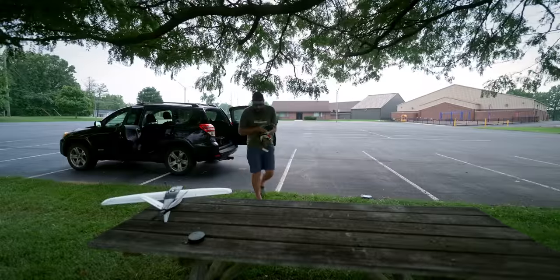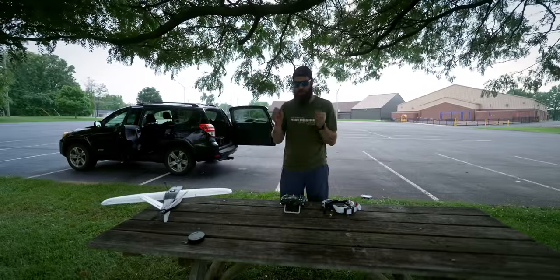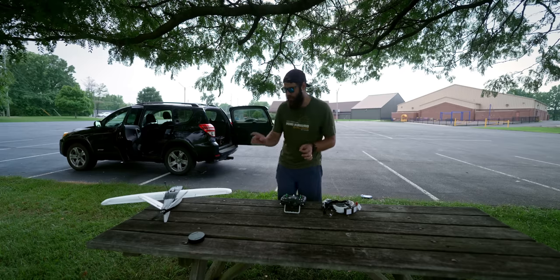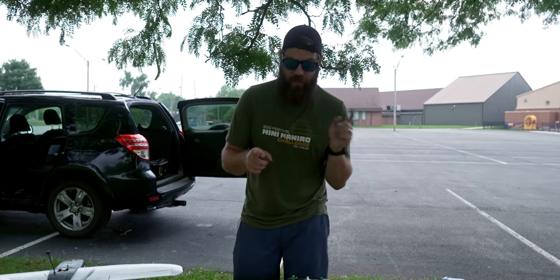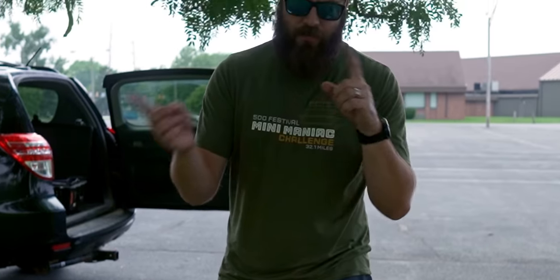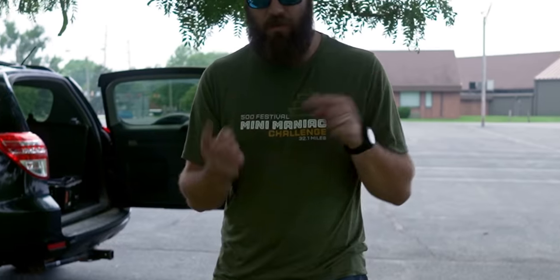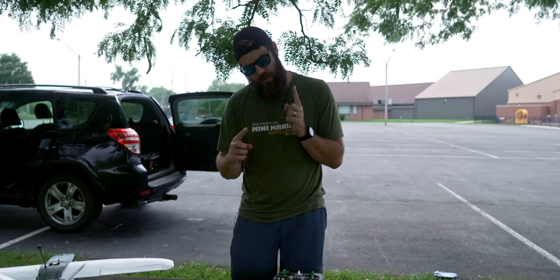Should have just stuck with drones. All right, we're out. Oh boy, I think we actually figured it out. Turns out I had the servo cables for each of the two servos in the V-tail on the wrong port. And I thought I had fixed it in software and then I didn't. And then I switched them physically and it turns out that I switched them to the wrong direction, and then unswitched them, then had the wrong software.